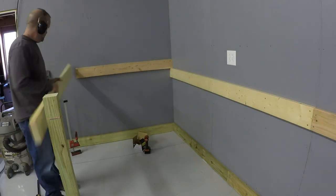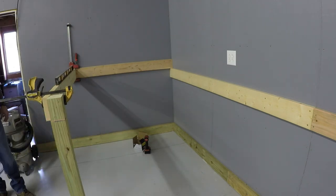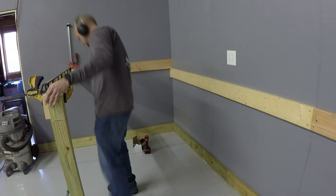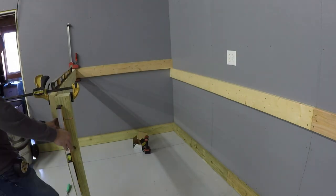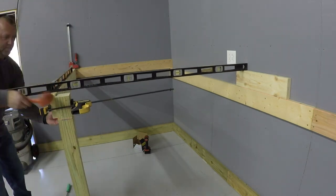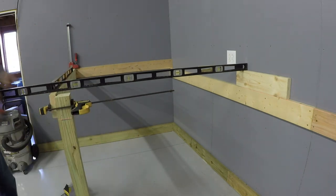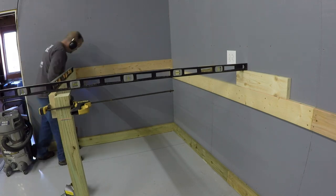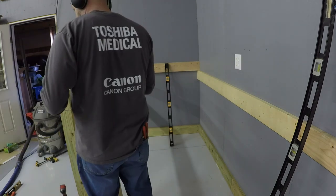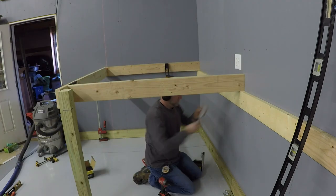Now we are going to put on the front board that will support the ends of the joists. This will not sit below the joists — instead, I will screw through this into the ends of the joists. I did not want this board sitting below the joists as it would limit the height of the items I could store below the mezzanine. I am clamping one end flush with an existing board and temporarily clamping the other end to a leg so I can tap it level. I cut my legs about a half inch short of the height of the mezzanine, since concrete is never perfectly flat — this ensures a little clearance between the top of the leg and the floor of the mezzanine.